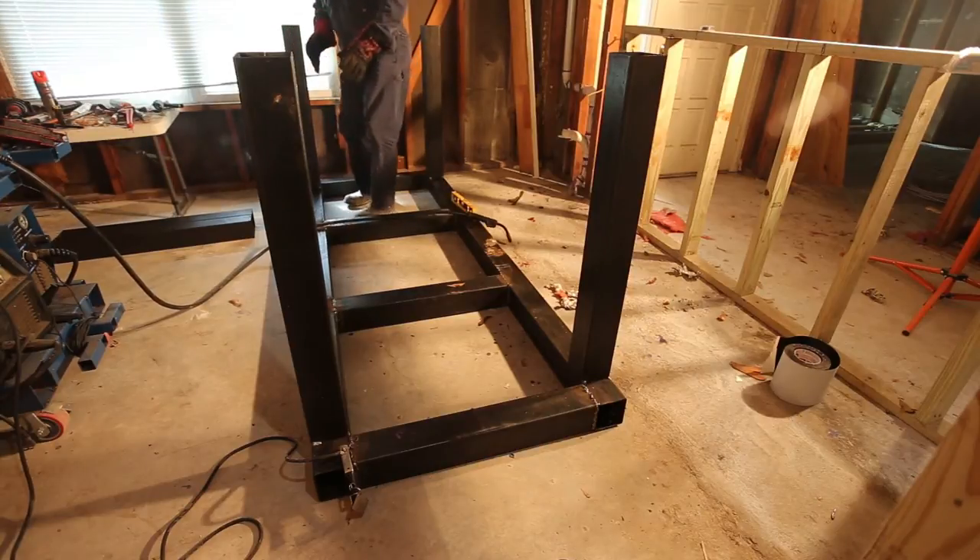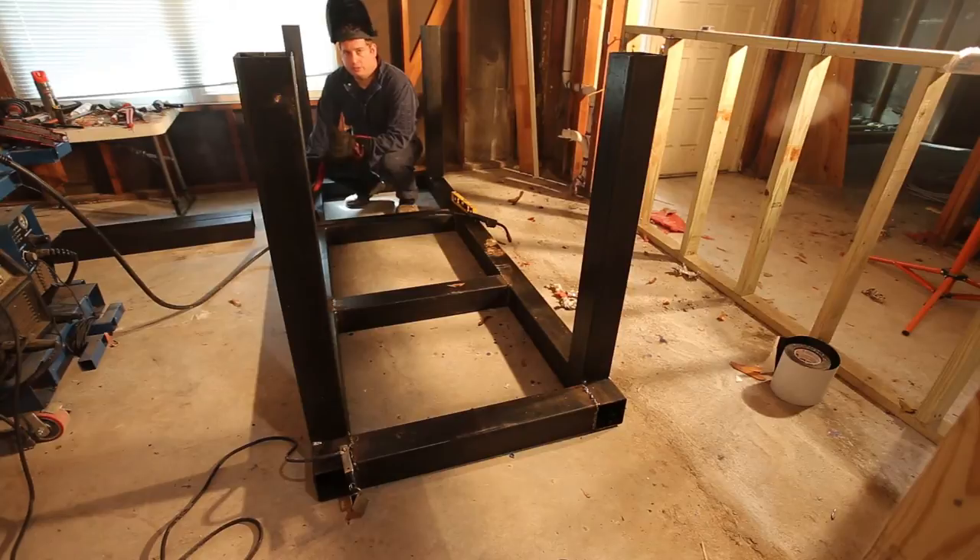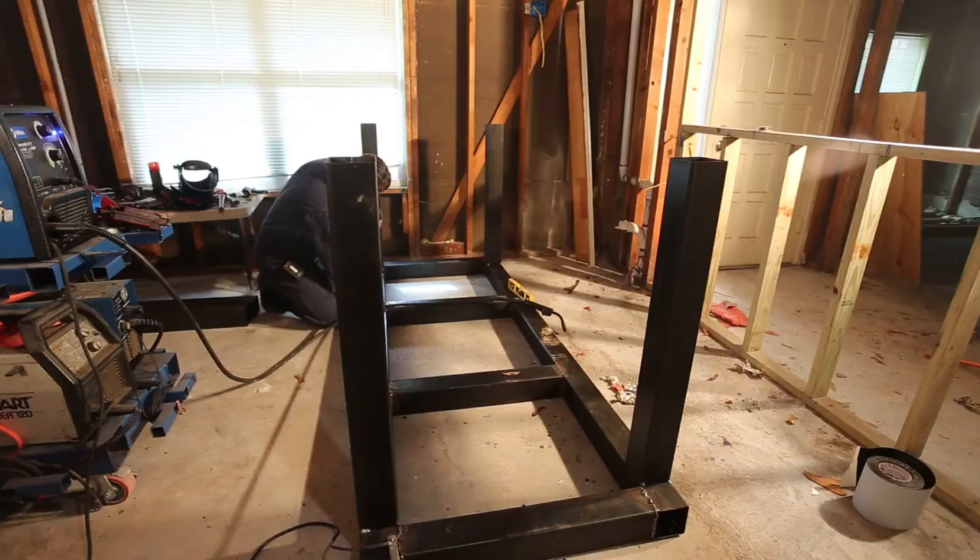You may have noticed I pulled the magnet off and then made the fourth weld. The reason I did that is I was already in position and comfortable, so it's easier to move the brace knowing it probably wasn't going anywhere than to reposition and find myself in an uncomfortable welding position. The next step is to measure the distance between these two and figure out where the middle piece goes — and I'm at 80 and a half inches.